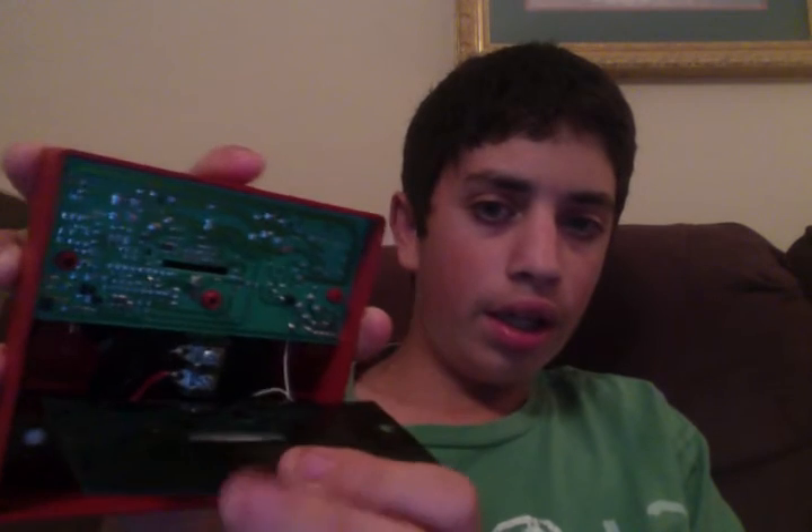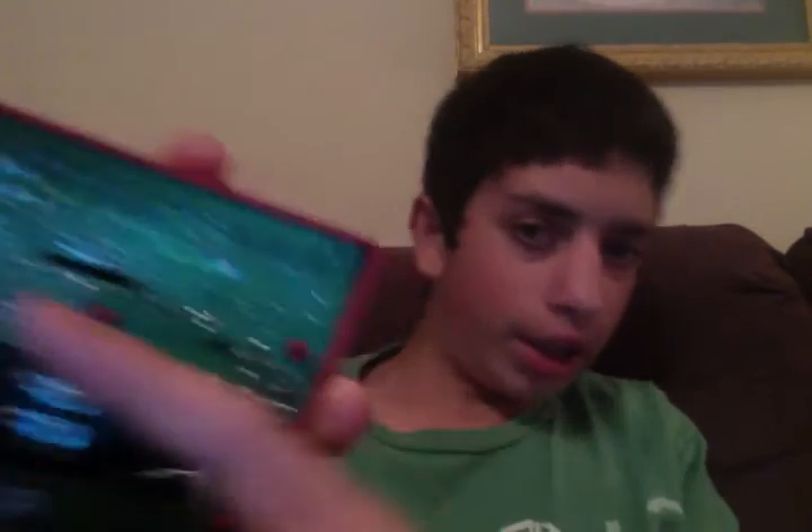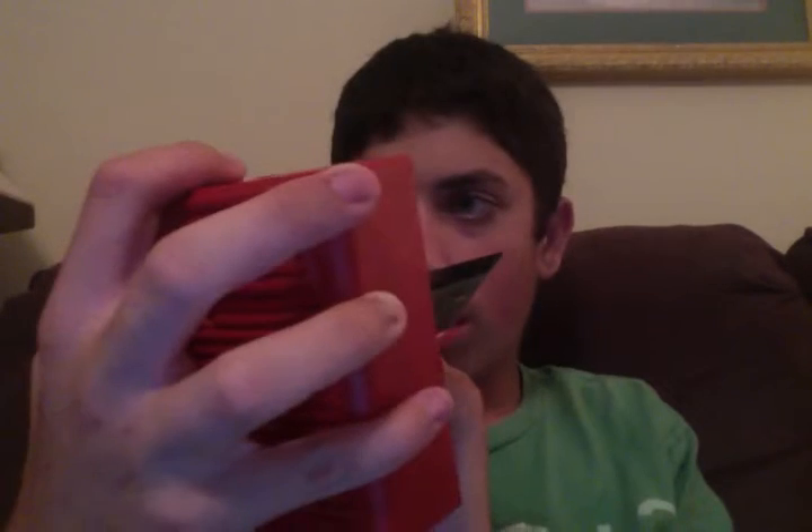All you have to do is take off — behind this back box there's a black thing, there's the circuit board, which has little things right here that just hold it in. All you gotta do is bend this plastic back — it won't break — take it off, and then you could easily take this plate right here off and add a strobe. But you need to put your own connectors in if you want to make it for a panel. If it's two wire, just put in a two-wire strobe and horn connected to each other, or solder them in somewhere.